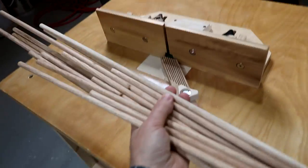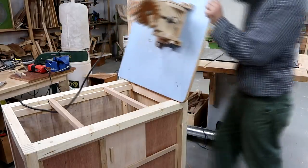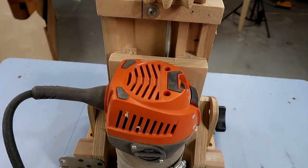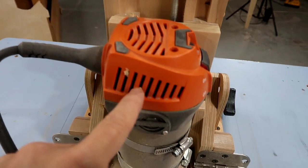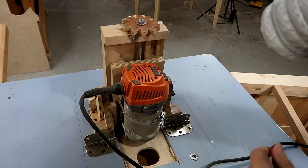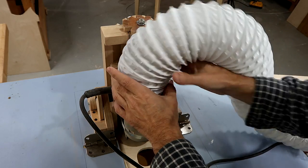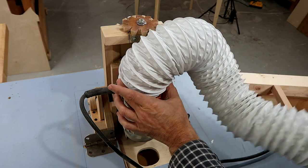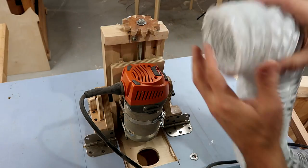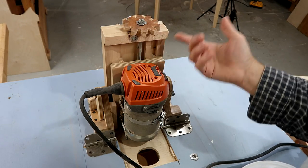I just made all these dowels — let's see how dusty the router is. That shows no sign of getting clogged up, though there are a couple of chips. The most suggested idea is that I put some kind of hose on here to the outside of the cabinet so the router can suck in clean air, but that's kind of tricky because it also has inlets on the side and the speed control here which I'd be blocking. Fortunately, a hose like that doesn't appear to be necessary.